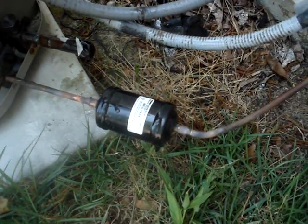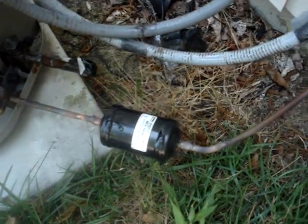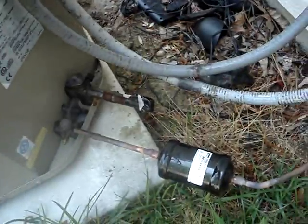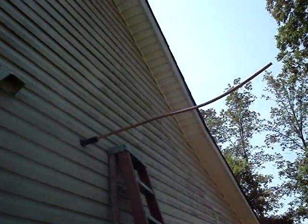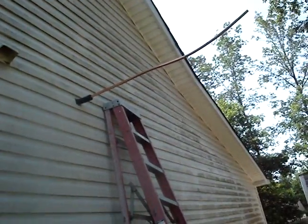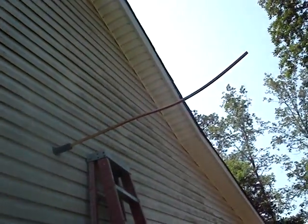I went ahead and added the bi-flow dryer. Had to wait to get some instructions on how to get in the house — it locked the door on me. So we're going to drill a hole, put up the channel, and run that new line to the air handler. We've got our copper pulled from the outside of the house into the air handler. I'm going to put the speedy channel up and run this section, then go inside and hang it across and tie in the evaporator.